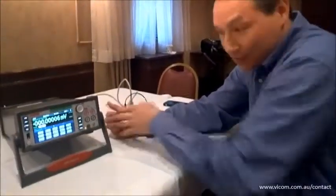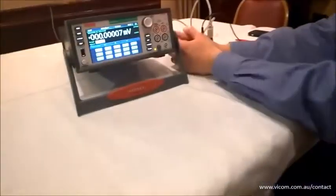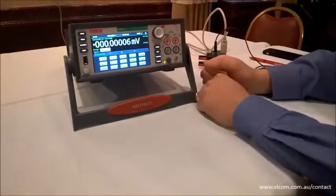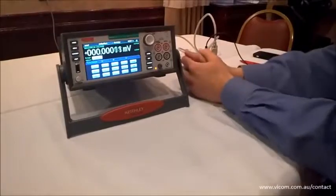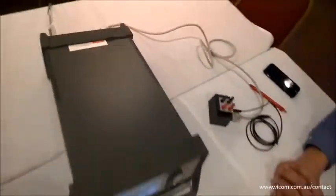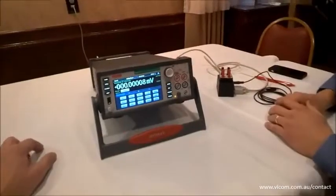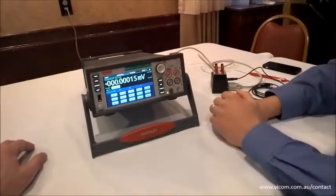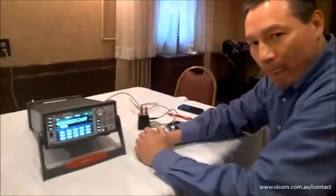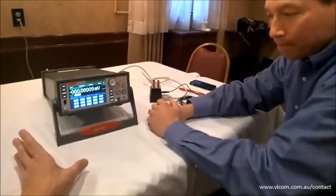Well that's very nice. Here's the front picture of the unit. You see it's a seven and a half digit DMM — we're actually monitoring a short here, so you see readings down into the nano volts. It has front and rear connections. Right now we're doing a DC voltage on that short. Excellent. Now what are some of the features? You mentioned it has a touchscreen — can you show us some of the touchscreen features?